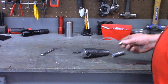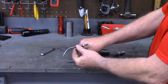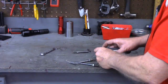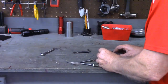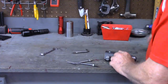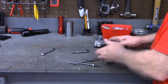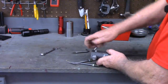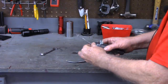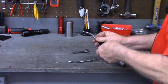Okay, I think we're ready to assemble everything. The two back legs that I've bent at approximately a 30-degree angle, I've got the lock nuts on them. So we'll insert our piece. And looking down in there, I'll drop a little steel ball in. Alright, now we can loosen that and rotate our piece without losing center. We'll thread these on and turn that out just a little.